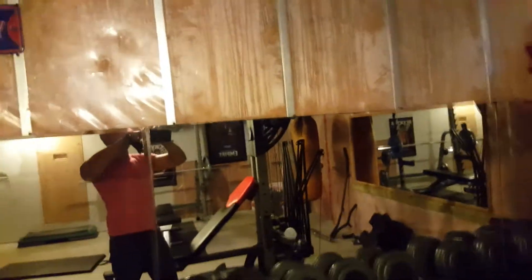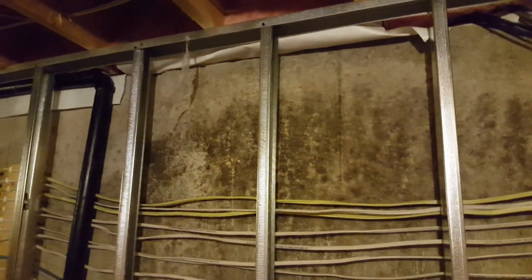If you've watched anything on my channel you've probably seen me use spray foam for basement walls when we're insulating, and you've heard me praise it several times talking about a thermal break — this is exactly why you want to use spray foam. And you want wood studs, you do not want to use steel studs. A few years ago I noticed it and I ripped out the insulation in this one section just investigating, and you can see we've got surface mold collecting on the concrete. So that's why we always use spray foam insulation in a basement.